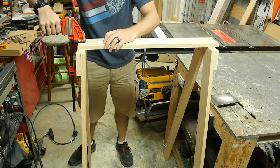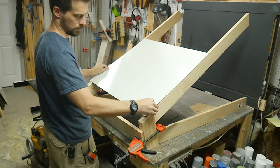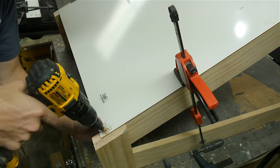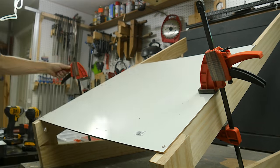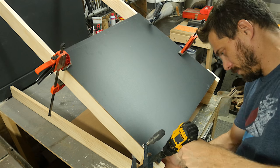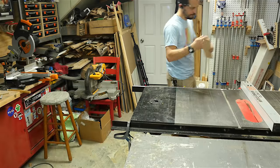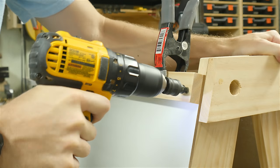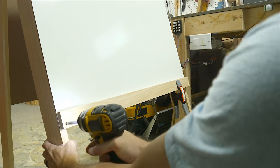Temporarily I clamped on a piece of wood to hold the two side panels at the correct distance apart. Once I had them at the right distance, I set it up on the table and marked the area from the top where I wanted the panels to start. I clamped these panels in place and then pre-drilled some holes right into the 1x4. Both the whiteboard and blackboard material are an eighth of an inch thick and kind of brittle — if you don't pre-drill the holes you'll probably get a nasty result when you drive in the screws. I drove in the panels on one side, carefully flipped the whole thing over, made marks for the same placement, and screwed on the blackboard to the other side. I cut a few more pieces of 1x4 down to strips — these make it look nicer but also hold the paper flat against the surface once you add the paper roll. I clamped these in place, pre-drilled and screwed them in, making sure there was not too much tension on the middle — just tight on the outside. This helps the paper to move freely up and down.